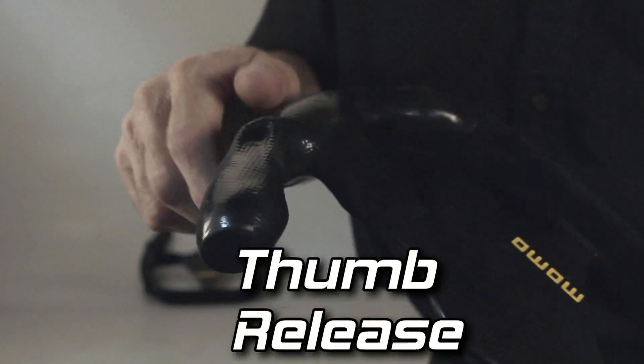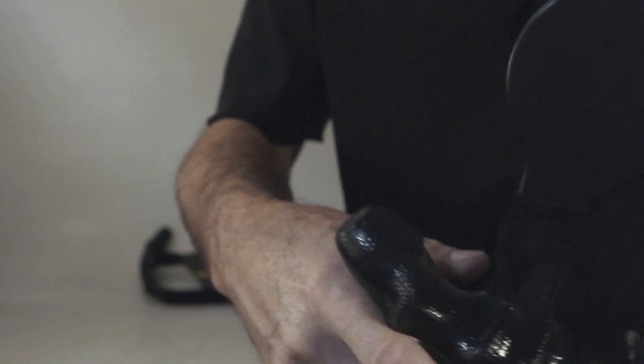The other area of concern is what I call a thumb release. Think about it — if the wheel were to suddenly kick back due to an impact on the front tire, if you've got a wing built up on the inside here like my earlier designs had, then you'd end up with a potential to not get your thumb out of there quick enough. So what we do is I now radius this area so that the thumb can escape.